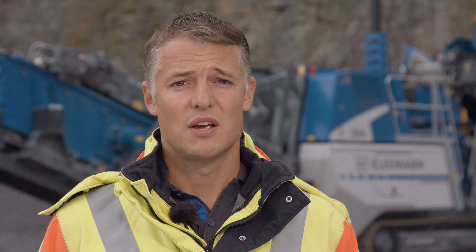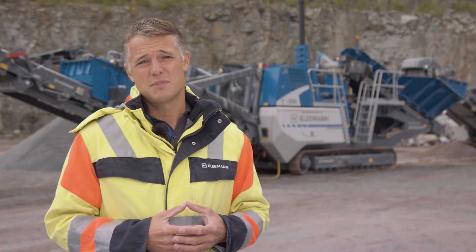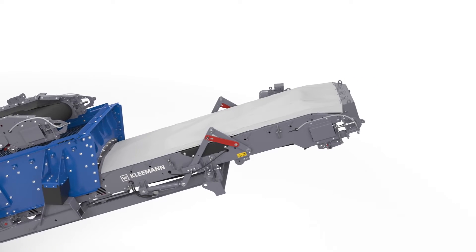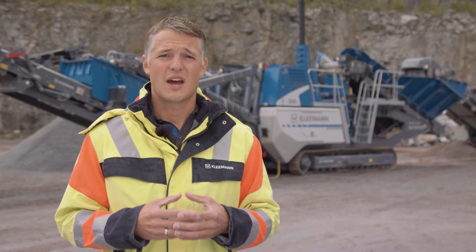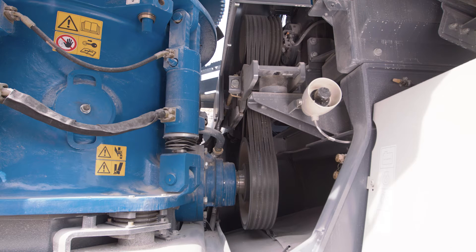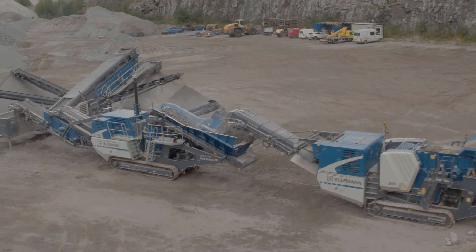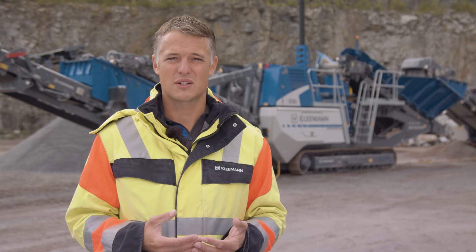This option also demonstrates the flexible and versatile use of the MCO90 EVO II. Apart from a modular belt concept which simplifies conversion from a short to a long belt, we completely redeveloped the belt covers. The tarpaulin cover can be removed in a few hand movements by one person without tools, meaning you reach the belt and the ceiling quickly and easily. We also redesigned the accessibility to the crusher discharge conveyor and the crusher drive. A belt scale is available as optional equipment for both the crusher discharge conveyor and the fine-grain conveyor, with quantities readable on the operator panel and in SPECTIVE Connect, where a report can also be created and sent.